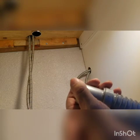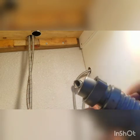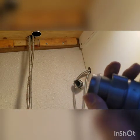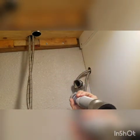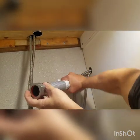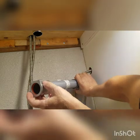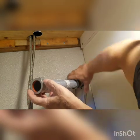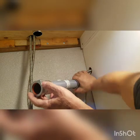Now let's put this on and show you how snappy this Snappy Trap is. Make sure the taper is facing outward. First, put this lock nut on there — taper going outward. Pull the tube out a little bit, stretch it out, get it in here nice and snug, then turn it just a little until it snugs up. Make sure the threads are not cross-threading — get it nice and flat to the surface and tighten it.